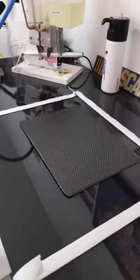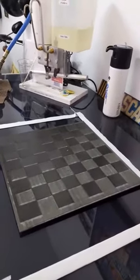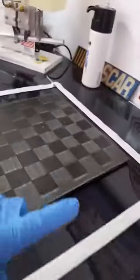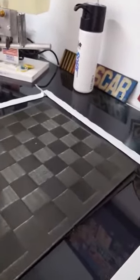Vacuum bagging, whether it be a clipboard or the checkerboard that we're going to do eventually, is the same when they are flat pieces. In this case, both of them are flat, so we didn't need to put any pleats on our tacky tape. You'll do pleats when you have an object that is 3D or goes up or down. But in this case, it's a nice flat piece, so we will just go forward with the tacky tape.